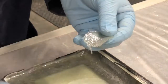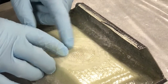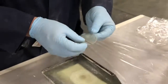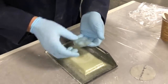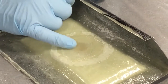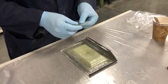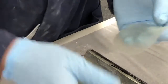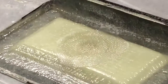The next layer is the inch and a half, attaching to a bias layer, so we want the warp fibers at 45 degrees so it ties directly to the bias sheet it's connected to. The following layer goes on the straight-cut section, so lay the warp fibers at zero or 90 degrees. Make sure they're straight and fit it so it connects to the straight-cut layer. Then the top layer — remove any inclusions like hair — make sure everything is nicely set up. The final capping layer attaches to the bias sheet on top, so put it at 45 degrees and make sure it's properly attached and seated.